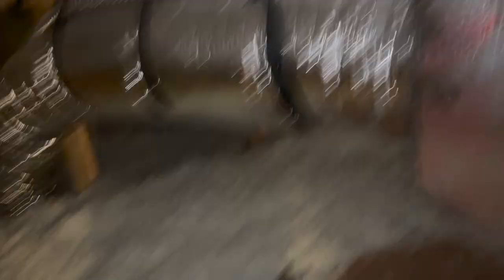The coil is clean — it's got a little bit of specs on it but nothing that's going to hurt anything. Most of the time the return duct is undersized on these systems, so let's take a look and see if that's the case on this one. This is a three-ton machine and I bet it's got a 14-inch duct on it. I can't find it — let me get under it. It's actually a 16-inch, okay, that'll work for a three-ton.